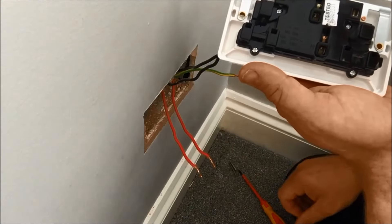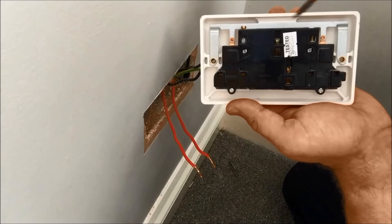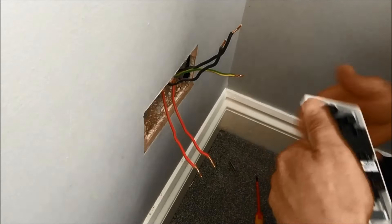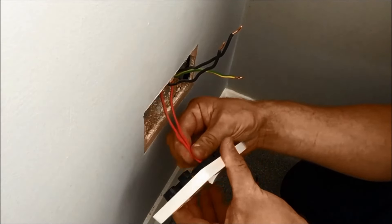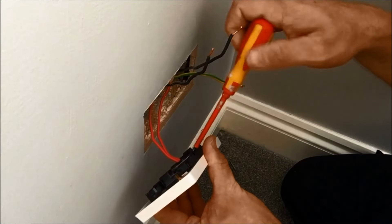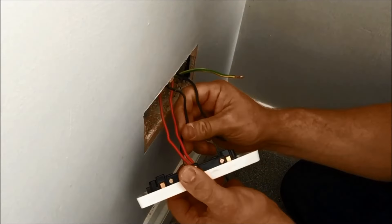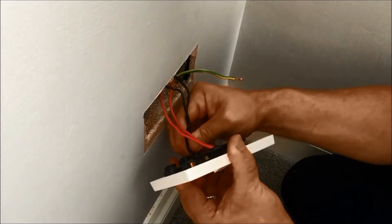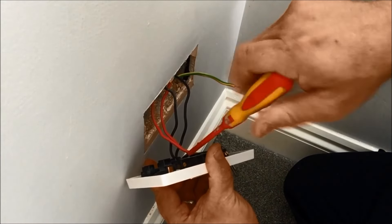With the new socket, on the back they always tell you which terminal is which. This one here is live, this one is neutral, and these two here are earth. I've opened them up to allow the cables to go in. Let's do live first — they go in there. I want to make sure there's no copper showing when I put the cables in, and I'm going to do them up lovely and tight. Neutrals next — that's on the next terminal down. Let's get them in. I'm glad I straightened these cables out. I don't want any copper to be showing. Now that one's in — let's do it up nice and tight.